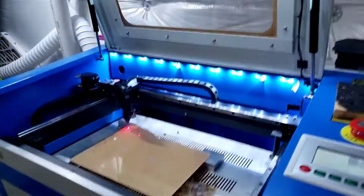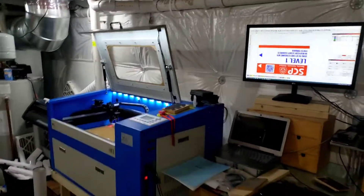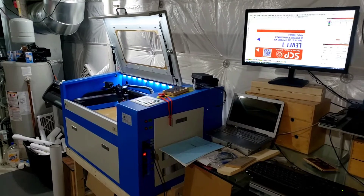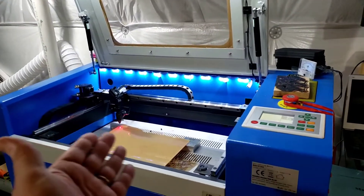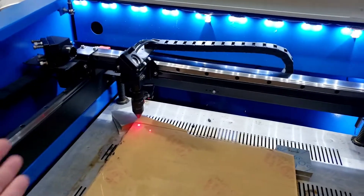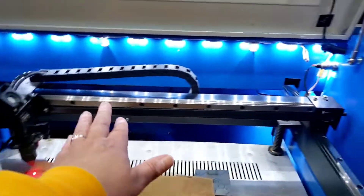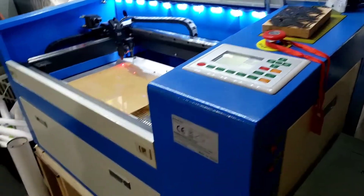My main focus is also cutting a lot of foam — things like foam inserts and shapes. That's about it for this showcase of the 50-watt China blue/white laser. There's nothing wrong with these machines for the budget. They're built like a tank. These rail carriage slides — if you're familiar with the CNC world, you know that's great equipment. It's probably over-engineered for a laser, honestly. They look like 10 or 15 millimeter slides — pretty amazing. Plus you have the electric bed adjustment.